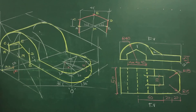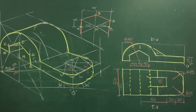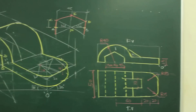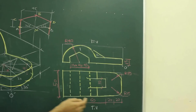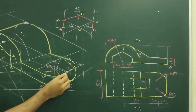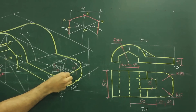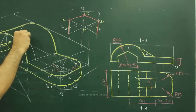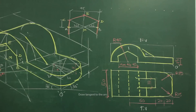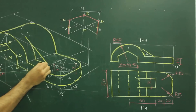All of you got this — what I did. I took this radius, I went inside by 20 and drew my arc. Then if you see the top view, you will come to know that this distance is 40 from this side. So from here we will extend the line and mark 40. Extend this line and mark 40. And from that point draw a tangent. So when I draw the tangent, I will automatically get this curve as well as this curve.